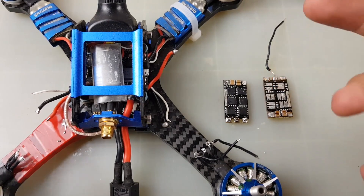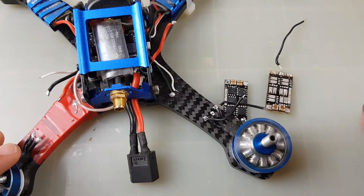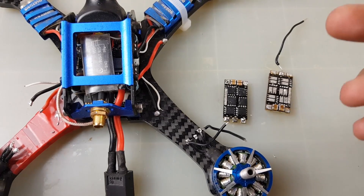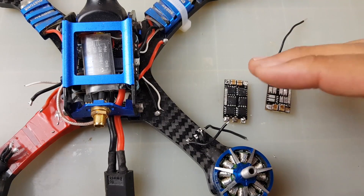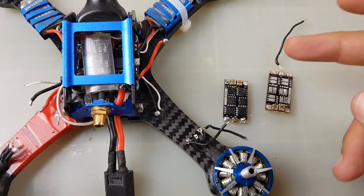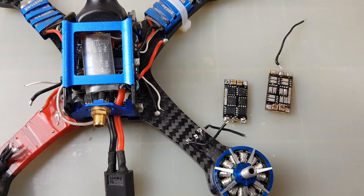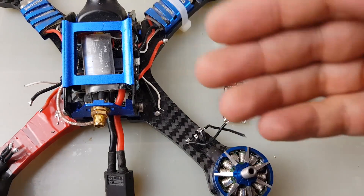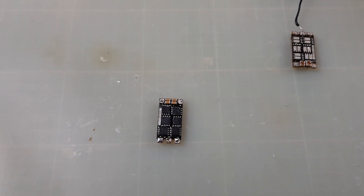The sign of a bad or failing MOSFET is your motor will jitter. If it's not spinning, first try to connect it to BLHeli32 or BLHeliS and see if it actually reads. If it does, it could be something from the chip down to the connection to the drivers or the MOSFET drivers. Currently this appears to be a MOSFET issue because the motor does turn on and jitter, so it has to be one of the phases. Let's go ahead and start debugging this one.